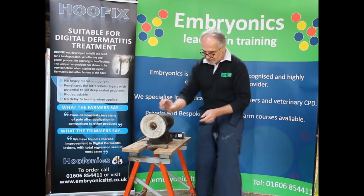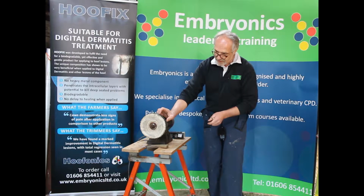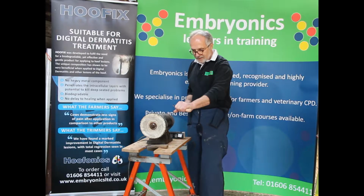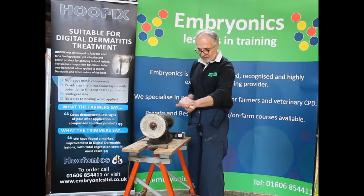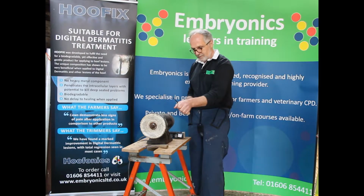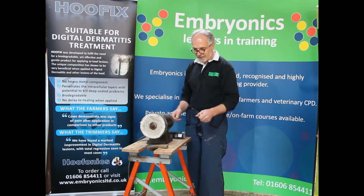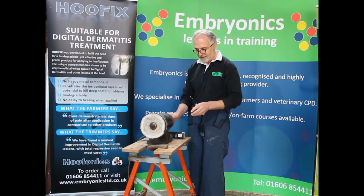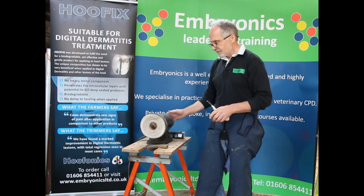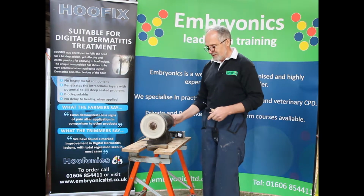When you've got the guards on, there's only a restrictive small part where you get access to the wheel for sharpening your knife, and it again restricts your movements, and you're far more liable to catch the knife either on the wheel or on the guard, and it either destroys the knife or it's a lot more dangerous. So it's less dangerous to have a grinder without the guards on it, and it's rotating. So we've got the grinder which is rotating away from us.